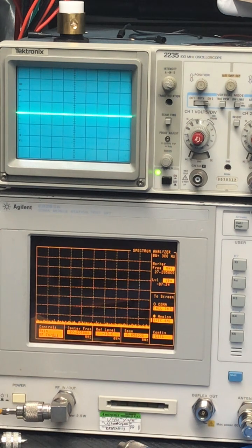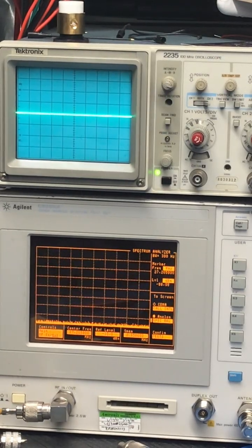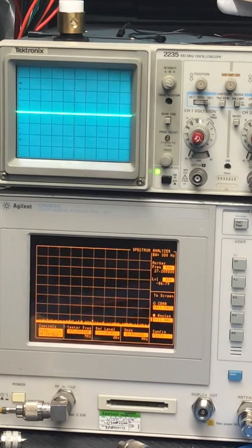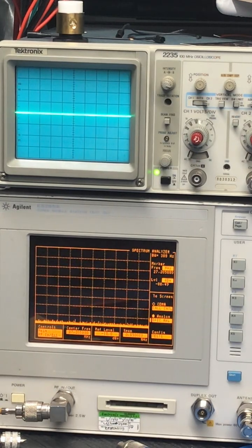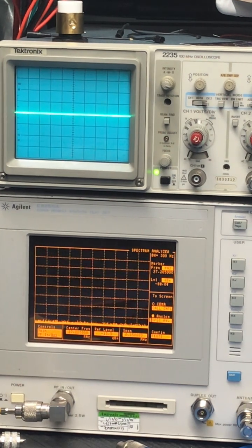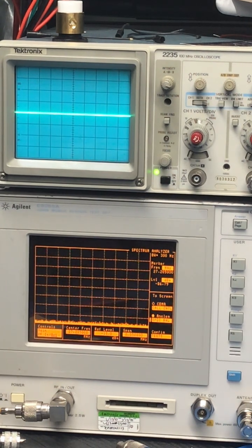But with that, keep in mind, once you do the positive peak expansion, the power on the radio is locked down, so you cannot do variable power on the radio. And that's just to protect the customer and to protect the amplifier, because if you crank that power up, you're out riding around and you forget that you've got the power up, and you turn the amp on and start keying up, not realizing that you're overdriving the amp. You got the chance of burning it up. It's definitely running hot, and you got a chance of blowing it up too. So we lock the power down.